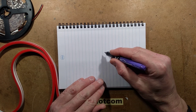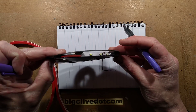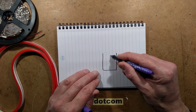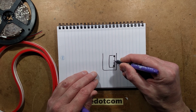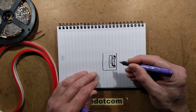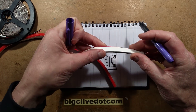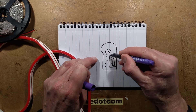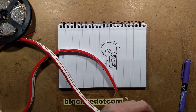Traditional neon-style tape has a white housing that reflects the light. If you just use standard LED tape pointing up, you'd get a row of dots along the surface. In the traditional case, you'd have a plastic insert in there - that's where they've cut corners now. They'd have the strip inside with the LEDs, and bus bars tied in every so often. The light fires out the side, and because this is white plastic, the light bounces around until it gets to the front, which is the translucent coloured section. So the light is bounced about until it emits from the front as a very linear line of light.